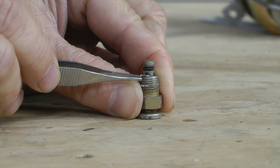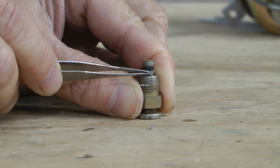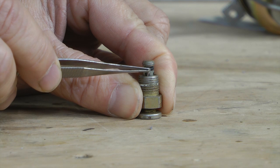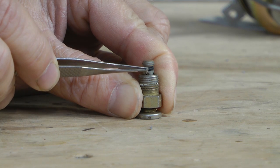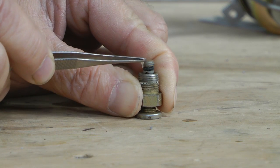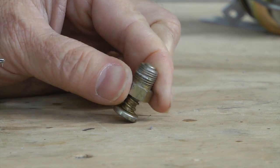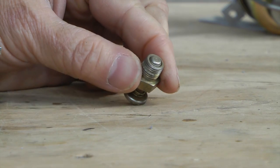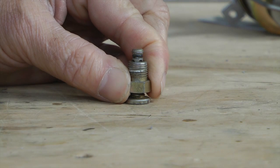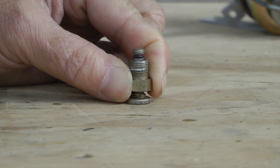A tiny piece of aluminum fragment — this came from aluminum tanks when drilling holes — especially when your homebuilt is new, if you don't get everything flushed out, a tiny shard of aluminum like this is all that is needed to keep this valve from sealing when you think it's closed. The fix is to simply remove the valve, open it up, and make sure everything is clean inside. Of course, the problem is all of your fuel needs to be emptied from the tanks first.